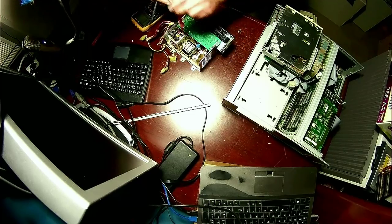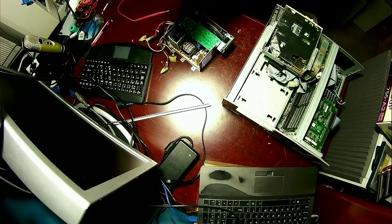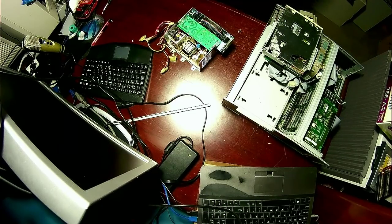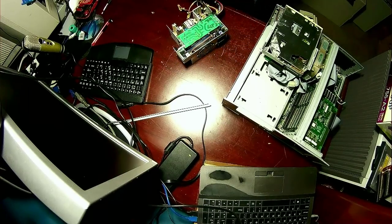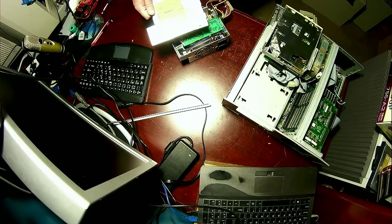Okay, so that's going to be the mission, to extract that bottom PCB out of there, and I can get a little bit closer inspection of that. It's probably a carbon film resistor. That happens on stereo receivers too, those things. The amp shorts, you know, you get one of those. There were a couple of those on that Fisher amp that weren't blown, just discolored because they got extremely hot when a couple of the MOSFETs shorted out, because it sent like 60 volts through there.